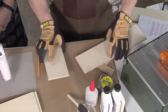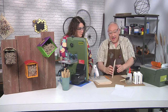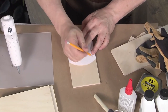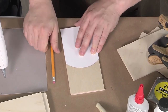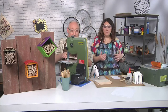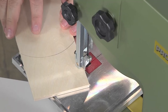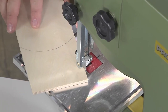So we have all of our pieces of wood. We have the four sides that'll make like a tunnel, and then a back — and I want a little arch on the back, so I made a pattern you can download on the website. Better to cut it too big than too little. I've lowered the guide on the bandsaw already so it's just above the wood. The blade is a big loop — if I didn't lower that, this could bounce. Now it won't bounce. We use a table saw to cut straight cuts, and the bandsaw to cut the curved cuts.